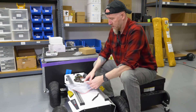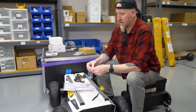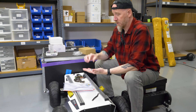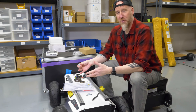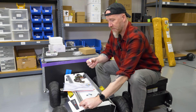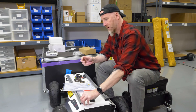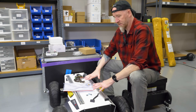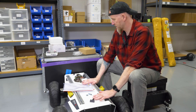You're also going to have some T-nuts — big, heavy-duty T-nuts. These work with the rail system on top of the robot for mounting all of your sensors, computers, robot arms, or whatever you're going to put on the system. Just pop off the caps on the end of the rails, and the T-nuts slide right in. Then put your bolts in and use the plates to mount everything, and the plates connect to the rail system. It's very nice.